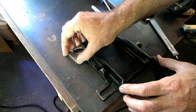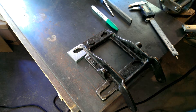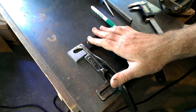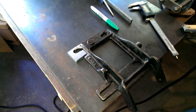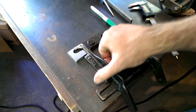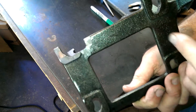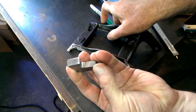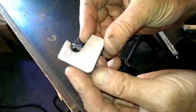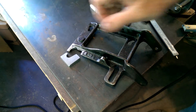Here are these two pieces ready to weld. I'll clamp this down and tack that in, make sure it's flat, and then weld it up solid. All this metal is prepped — I took all that casting back, that's all fresh metal. Same thing here. Deburred all the edges, all the oxidation is off. This whole thing is clean and now I'm going to clean it with Windex.